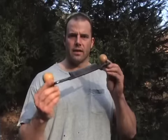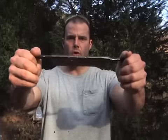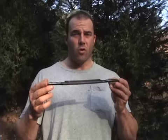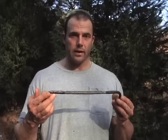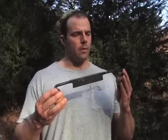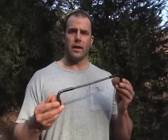For the next stage of making a bow, you're going to need a draw knife — it has two handles and you use it to remove wood by pulling it towards you. If you don't have one, you can improvise with an old leaf spring or an old machete, but those are more or less second-rate substitutes. If you're going to make a lot of bows and do this seriously, a draw knife is what you really need.